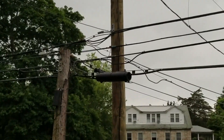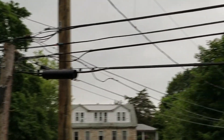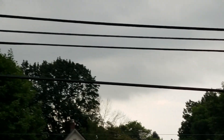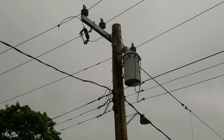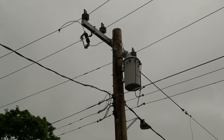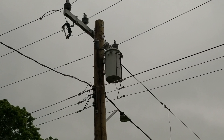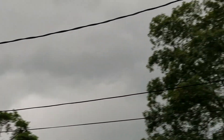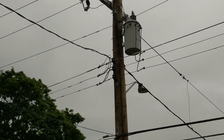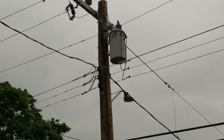The lower cables on the pole are for cable and telephone — they're low voltage, essentially bundled cables for your communications network. But the real meat of what's going on is three-phase power coming in, protection devices such as fused disconnects and overvoltage protection, transformers that step down the high voltage to a lower voltage, and those small cables that come into your house feeding your circuit breaker. If things ever go wrong, figuring out how to break into this system for the average person is going to be futile.